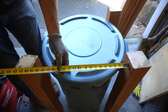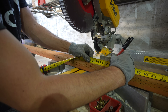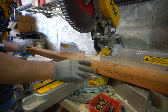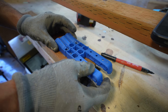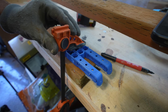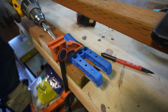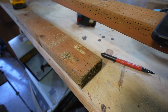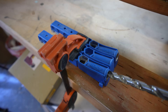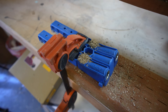The very front panel is the most important because the other sides are going to be more integrated into the front panel. In order to install our paneling more easily, I figured some cross bracing from post to post is going to make it a lot easier, so I cut some pressure treated 2x4s down to 20 inches, which will give us the perfect width framework to enclose our bin. In order to secure our cross bracing more easily to our post, I grab our Kreg pocket hole jig and pre-drill our holes ahead of time so it will make it easier to install and our holes are completely flush with no fastener heads getting in the way of our paneling.